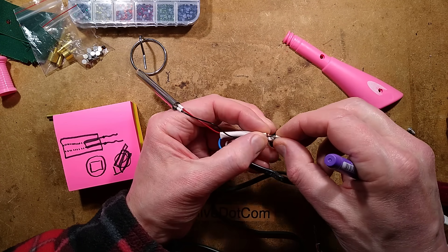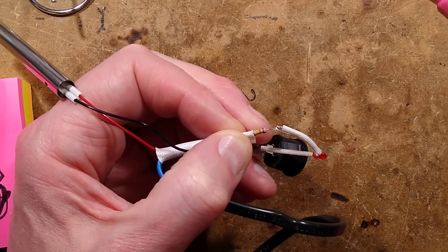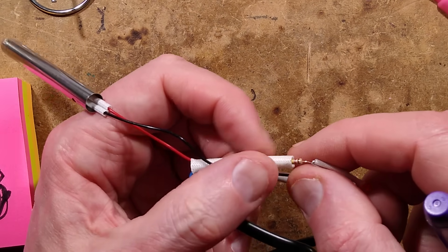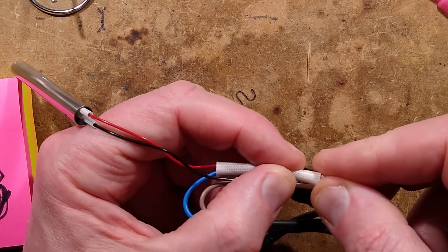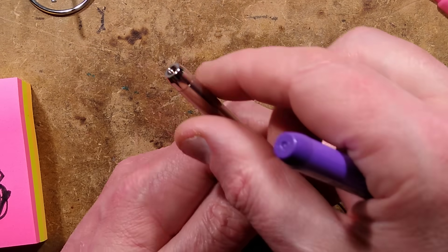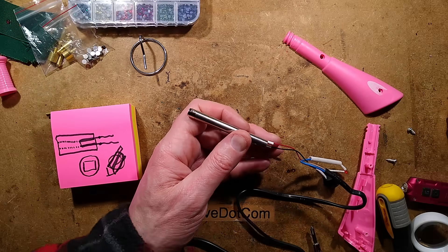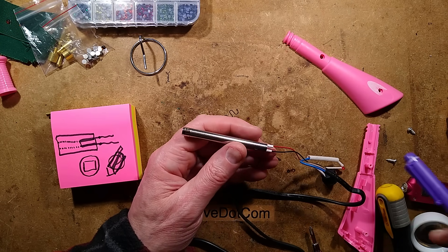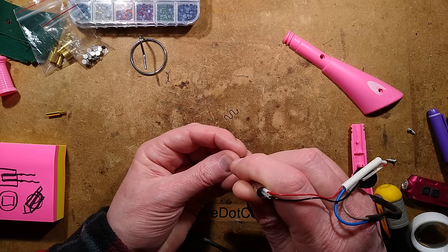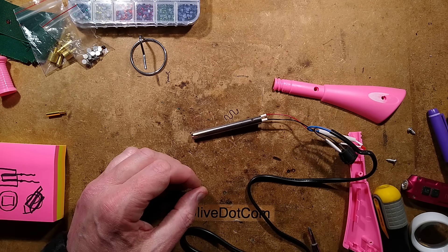As far as the little indicator LED goes, there is a brown, red, yellow resistor — that is basically 120k — which means that resistor is going to get very hot in use because it's being well grilled, well above its rating. It's fundamentally just a switch — an LED as an indicator that it's on — and then the little PTC self-regulating heat element with the screw-in tips used to melt the glue. Interesting enough device. If you want to put diamantes on things, maybe you could also use it for pressing heated inserts into plastic. An interesting little device — very basic, very simple, very functional, and best of all fairly cheap.